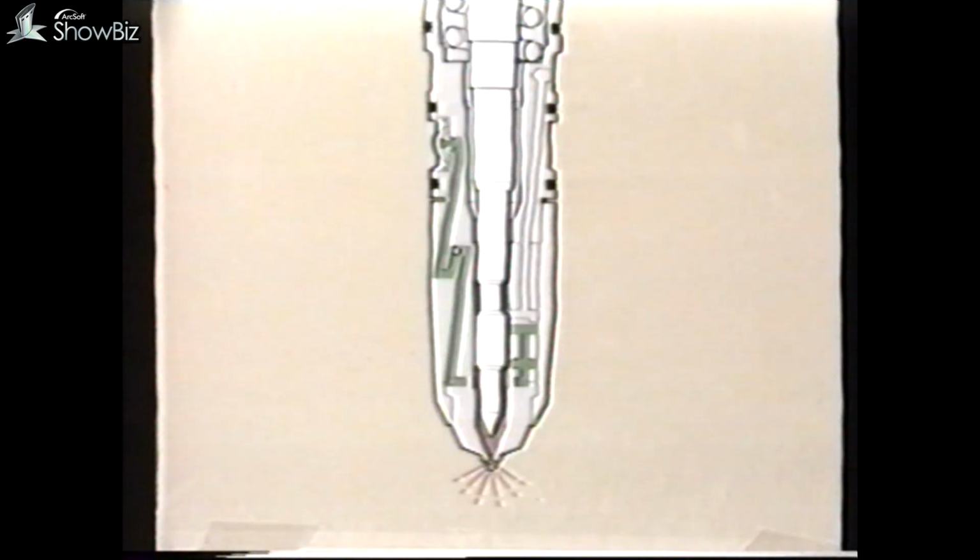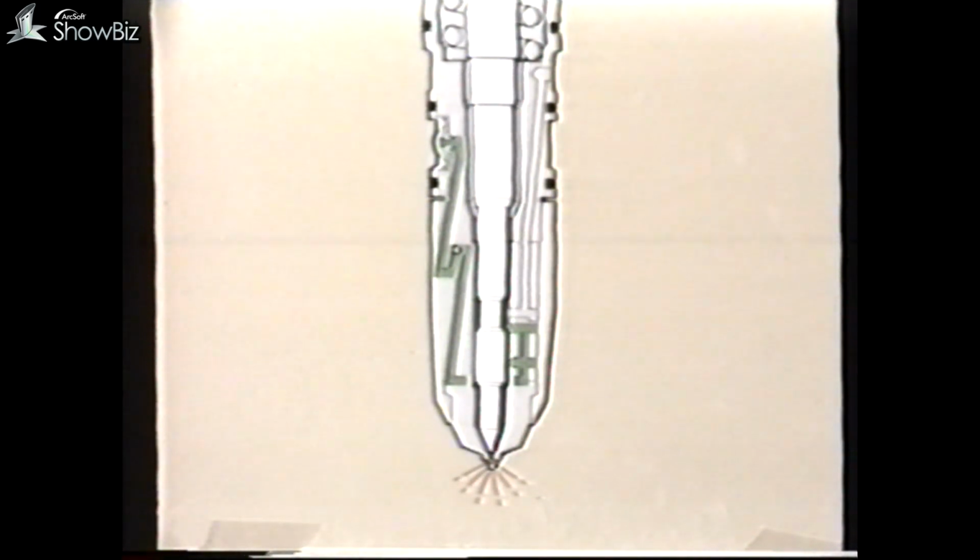When the injectors are adjusted correctly during the injector stroke, the plunger just contacts the injector cup at the end of the injection. And to ensure that all the fuel is expelled from the injector, the camshaft is designed to load the injector plunger for a short period to squeeze out any fuel that may be remaining. This is known as cam nose crush. This feature avoids any possibility of fuel being left in the injector, which would result in a carbon buildup on the cup. You should be aware that if the injectors are not set correctly, it will affect the fueling of